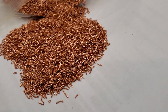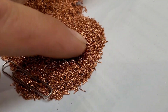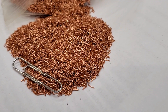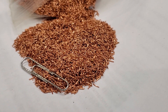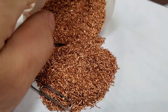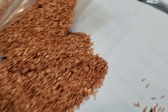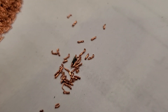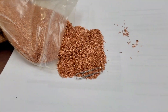Here I have a few samples. This here is granulated cat five wire — for reference I'll hold it up. This cat five was chopped with three granulators back to back, then went over a screener to make sure no plastic was still stuck to the copper. Pieces that didn't pass circled back through the original granulator and through the whole loop again. I'm not saying you can't make very nice clean copper this way — this is beautiful copper — but even here there's a small piece with insulation still on the outside.